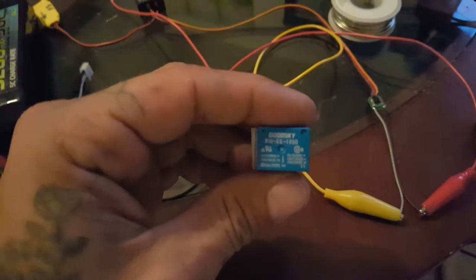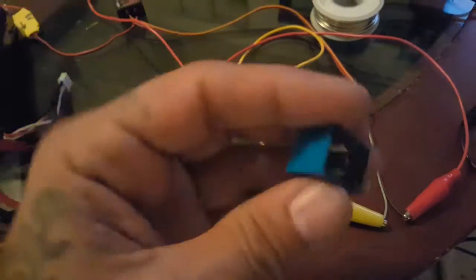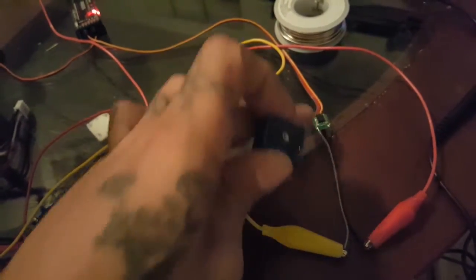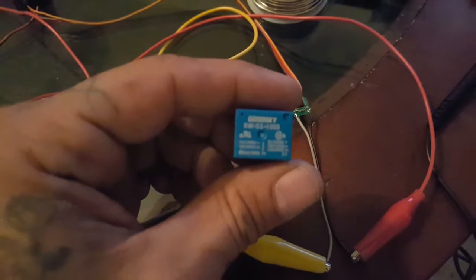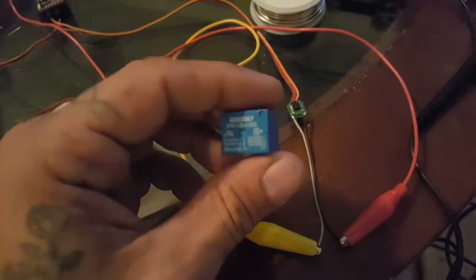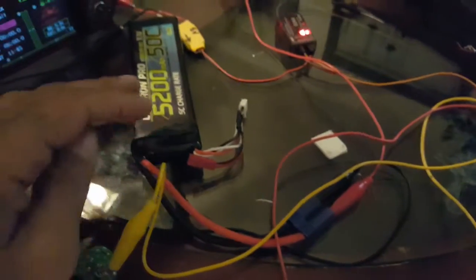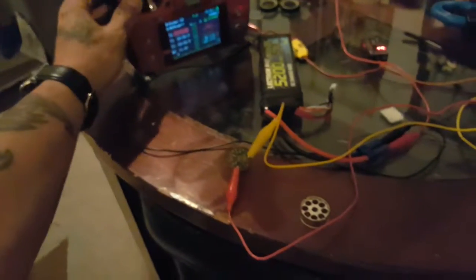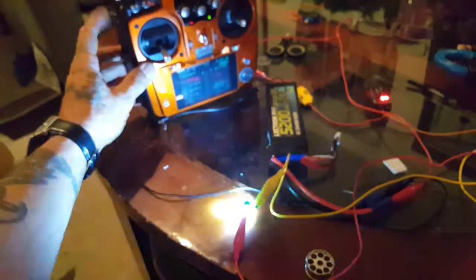What I am doing instead is using one of these relay switches. Right now I'm using 5 volts out of the servo board — the LED light, amp draw, and all those little indicator lights are right at the breaking point for the circuit board. So I'm going to connect this to a 12 volt relay switch: 5 volts on the coil, 12 volt pass-through — and I'll be able to power 12 volt sources right off the battery pack. I'll do that next. Works good.